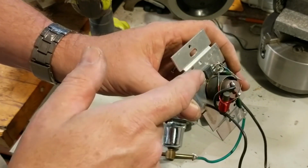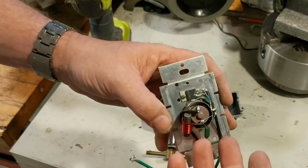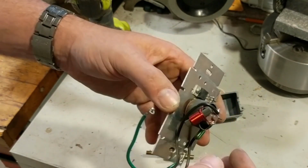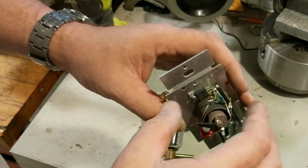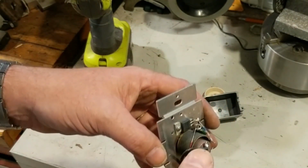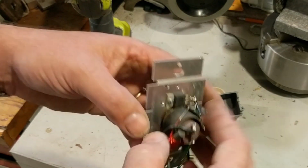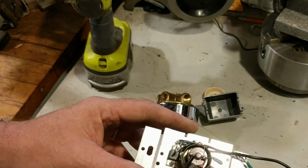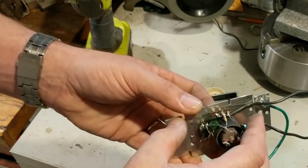Speaking of danger, the one thing we need to be absolutely certain of is that none of our 110 volt connections are in contact with any metal part of the frame. In fact, not only should they not be in contact, you might say, wrap it in black tape or something. Not only should they not be in contact, there really needs to be an air gap, because black tape degrades over the course of just 2 or 3 years, 10 years at best. So you can't be trusting something like black tape down the road. Hopefully this cool lamp that we're going to make is going to be around for, well, let's face it, generations. So this has to be actually insulated by air.